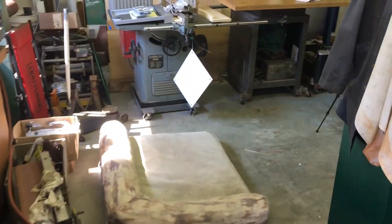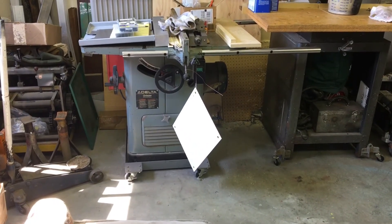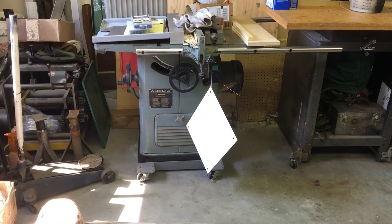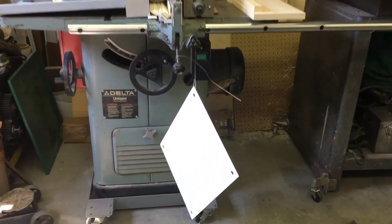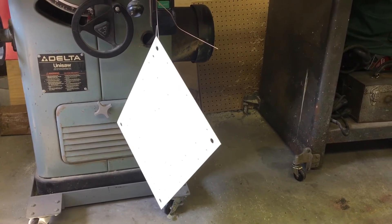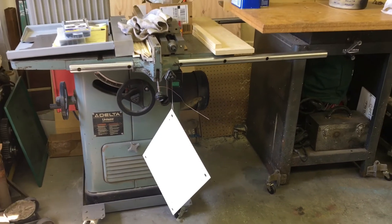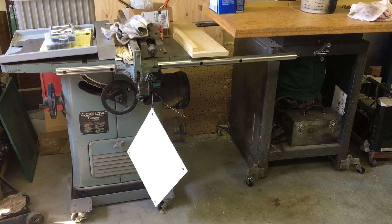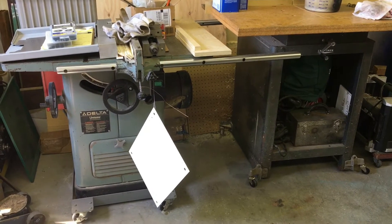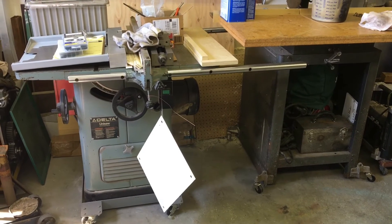Coming into this pigsty — that's the panel that bolts into the electrical enclosure. All the switches, contactors, VFDs, and whatnot bolt to that. It's just epoxy white — like refrigerator white.